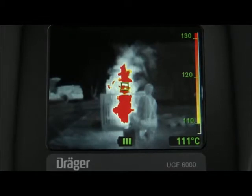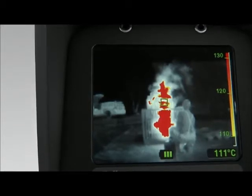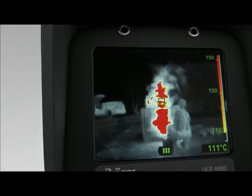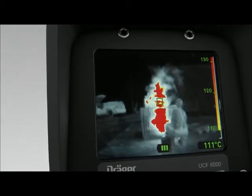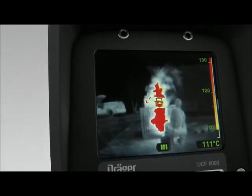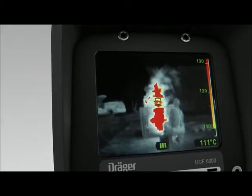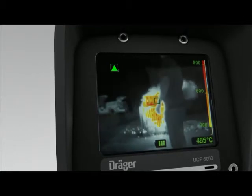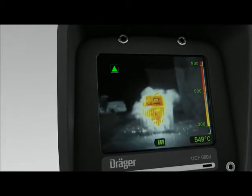This indicator is activated when the laser is enabled. The symbol on the top right is displayed in high-temperature display mode. The color coding key is displayed on the right of the screen and is divided into two levels. The first level shows temperatures from 110 to 130 degrees Celsius. If the majority of points is hotter than 130 degrees Celsius, the camera switches to the high-temperature display.